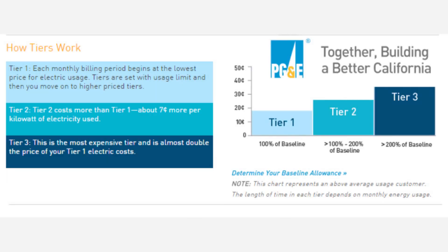That's really nice for people who have different levels of rates from the electric company — it can help bring your usage down to a lower tier so you're paying less. There is some complicated math involved, because you do have to take into account what it actually costs to cycle the batteries. It can cost 16 to 20 cents per kilowatt hour when you're cycling those batteries and taking the life of those batteries into account. So if the customer is only saving 10 cents, energy storage may not be the way to go. But if it's getting into 20, 25, or 30 cents, there's real opportunity to use energy storage to mitigate those costs.